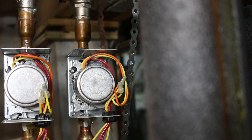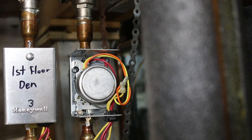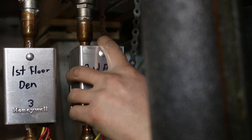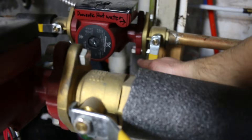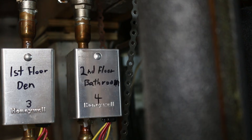Let's fire this back up — this is done. The whole thing took about maybe 10 minutes. I have everything turned back on, no leaks, looks good — we'll call this done. I have heat upstairs now. The only thing I should mention is you might need to bleed your system after this because we've introduced just a tiny bit of air into it.